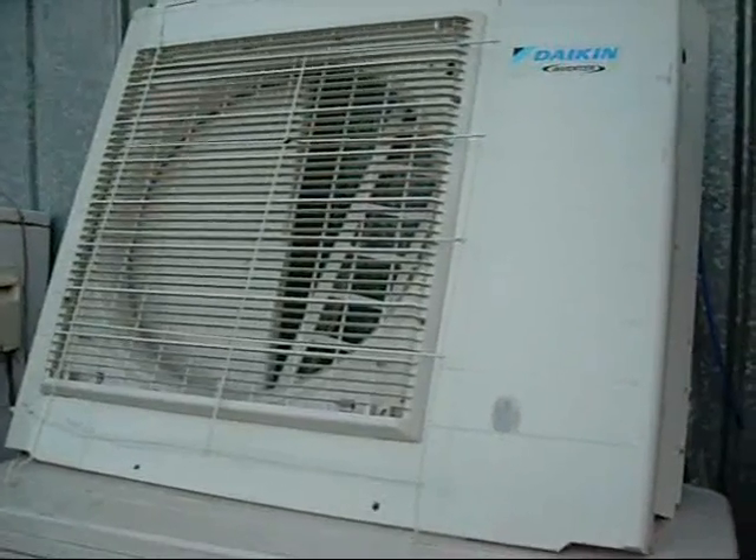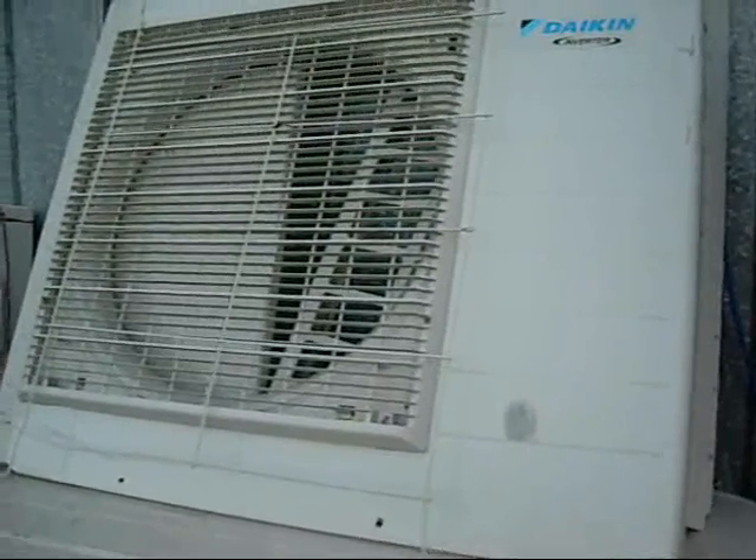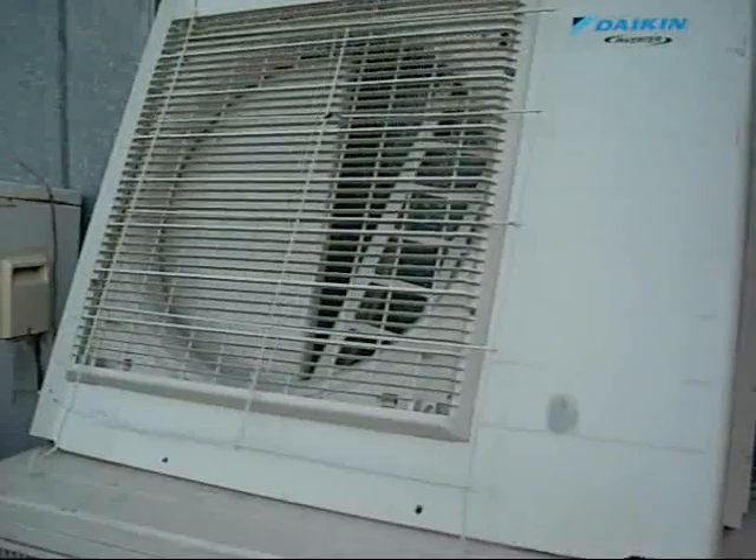I've found it's charged with R22, not R410A, and it's got a very good charge in it. Basically I'm just going to find a decent sized coil — there's no model number so I don't know how many kilowatts it is — but I'll just find a decent coil for it and turn it into a heat exchanger or something.